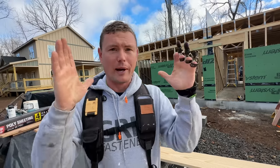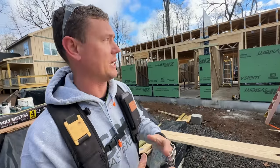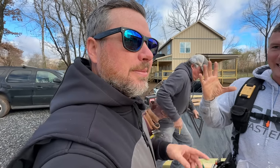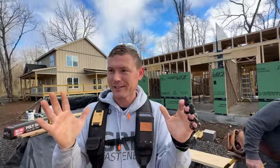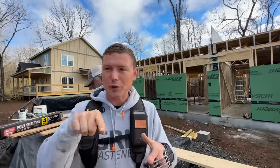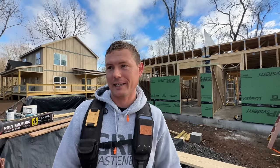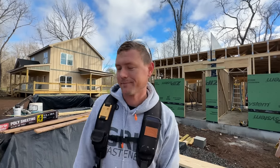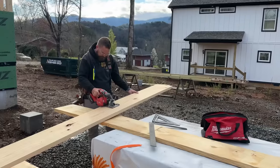We're actually using the squared out section for duct work because we're not going to have a rigid square duct taking up that space. So that's a great space for us to actually put in the brace. You know, they specify it to go on the outside of that square thing. And they've got these oversized nail plates, the stamped plates on the trusses. Anyway, they have it drawn on the drawing right there. And they show it overlapping. They show them intersecting. The plates. There's no way. That wouldn't work. No, no, no, no. We're not doing that.